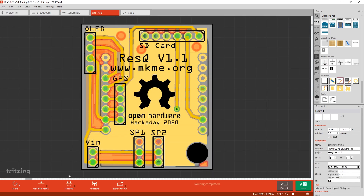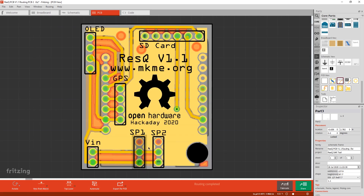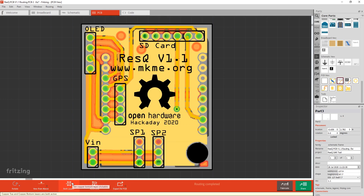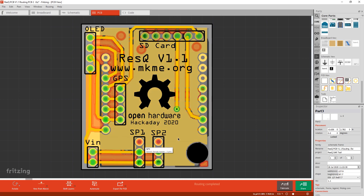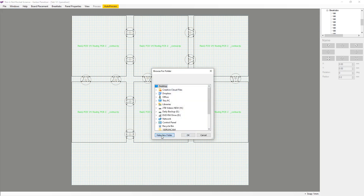Some pretty easy routing and some ground fills on both sides and we have a PCB that we can send out, but this is a really small PCB. So we're going to want to panelize it, or have our board house panelize it for us. We're going to be using PCBWay and today I'm going to do the panelizing for them. The process is super easy — you lay out the files and join them all with little mouse bites together and it'll generate the Gerbers.